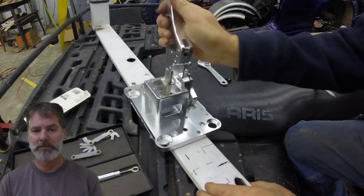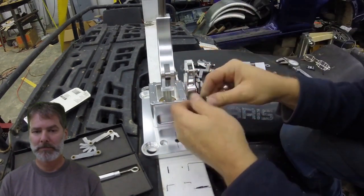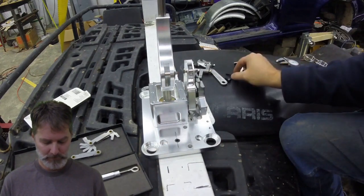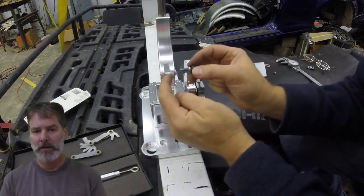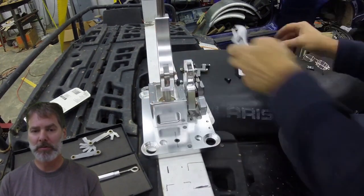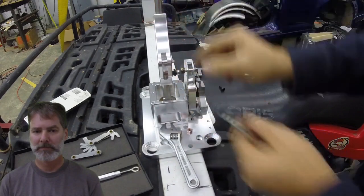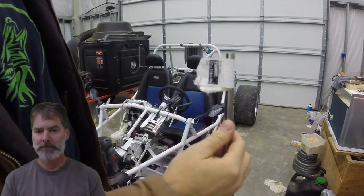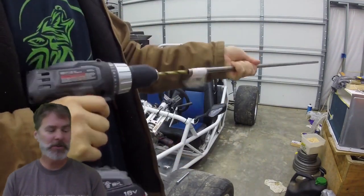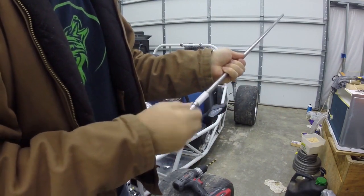I've been having a little bit of fun trying to hook the cables up to the connections on the back of the RSX shifter. I'd like to connect right in the middle of the shifter, and instead of using a ball end, I'd like to connect one with a heim joint on it. Originally I was going to see if we could do it with parts I had at hand, but I soon discovered I need to order more parts. I didn't really like the compromises like putting the ball joint on the side. I got some half-inch outside diameter tube stock with a 1/16th inch wall. At this point I pretty much convinced myself I need to use the welder and fabricate some different parts. There's my pivot system.